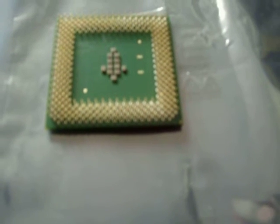There are 370 pins on these sockets and therefore on the CPUs. Turning it over, we can see them, along with some surface mount components. If you look at how densely packed these pins are, they're actually very sparse compared to a CPU you'd find today that uses pins — which is basically just AMD. They're large and very spread out compared to what you'd see today.